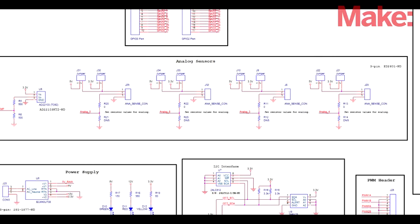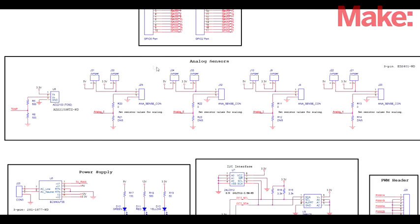I also include analog sensors as a fixed sensor and as adjustable sensors. Most of these adjustable sensors have a 3-pin termination, 2 jumpers to control whether they are 5 volt or 3.3 volt controlled, and the output line going into the processor. These lines are adjustable by dual resistors, so I can scale them for the input.